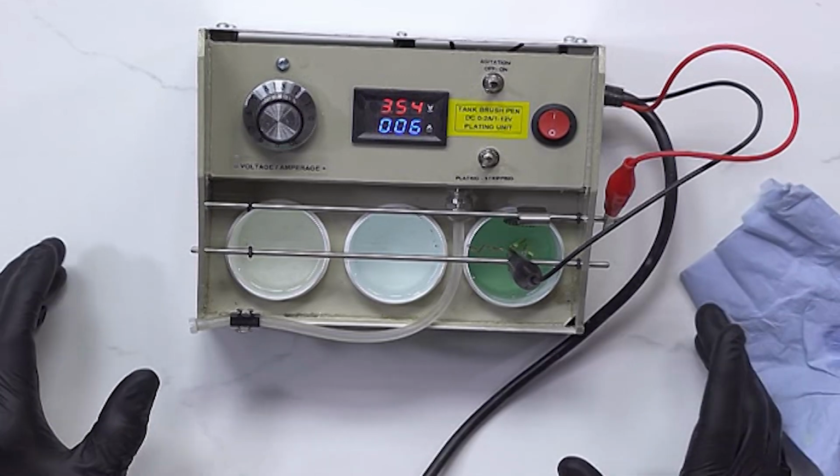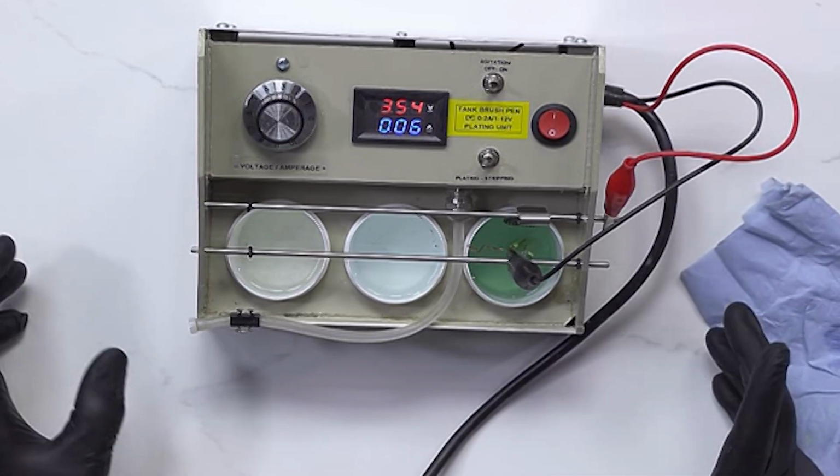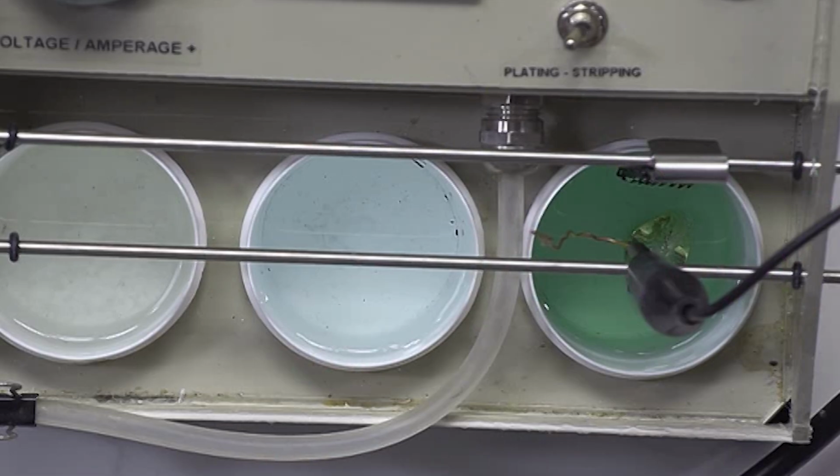This plating solution can plate out 1 micron every 8 minutes at room temperature. So we need to determine how much we wish to plate. You can plate as little as 0.1 microns, half a micron, 1 or 2. The international standard for vermeil, it's spelled vermeil, is 2.5 microns. That's a legal standard in the United States. That does not exist in the UK. And typically we see 2 microns here in the UK as a standard thickness of plate for gold plating.